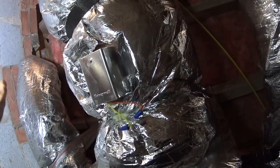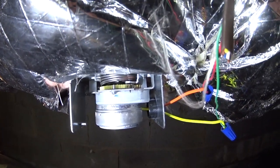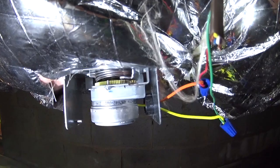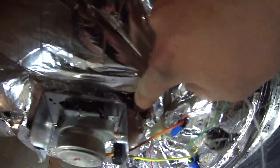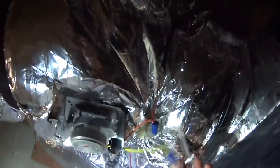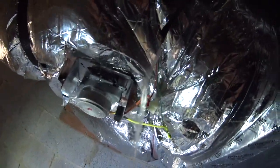actually moving any air. I'm gonna take the cover off and just see what it looks like and give it a test close. So I don't see anything wrong with the gear, at least on this side of the unit, but it is jumped to power closed and the damper handle is still over here in the open position, and I can't say for sure if we've got power here. I haven't got my meter down here yet to confirm, but the wires are contacting and ought to show power when I put a meter on it.